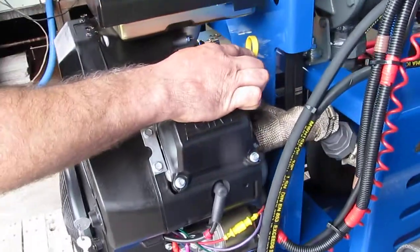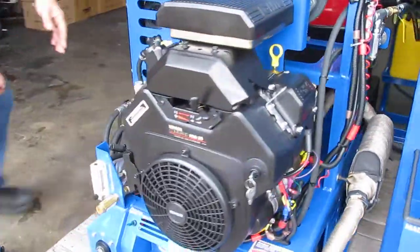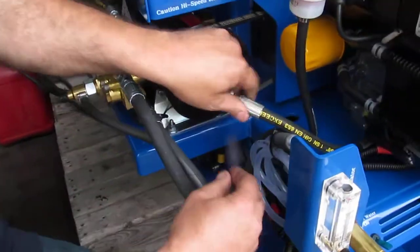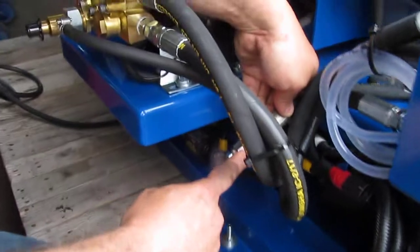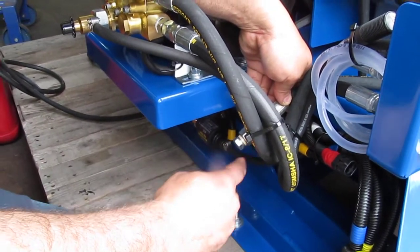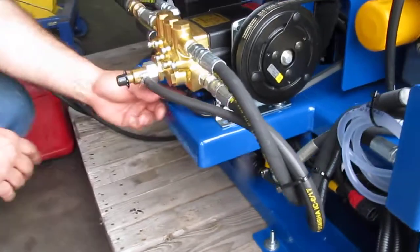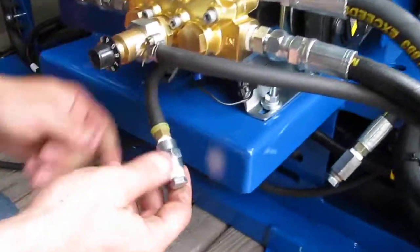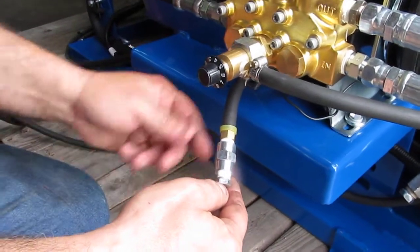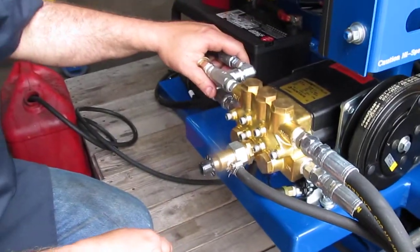One of the main areas prior to startup: make sure you check your oil level. The engine takes two quarts of 10W30. For draining the oil, there is a hose here you can simply use. It takes a 7/8 to secure the coupling and 11/16 to remove the plug. After you drain it, put some Teflon back on the plug and reinstall it. Your pump can also be serviced and drained using the hidden holes — use a 3/4 to secure the coupling.